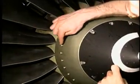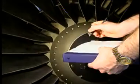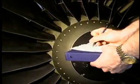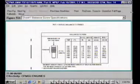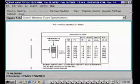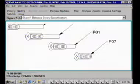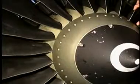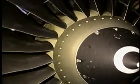Note that fan blade and balance screw numbering is counterclockwise forward-looking aft. At the first location to the left of the offset hole, record the P0 number on the head of the balance screw. If you cannot read the balance screw P0 number, measure the screw and determine its value on the chart in the Boeing Maintenance Manual. Note that P07 screws are zero weights and do not need to be recorded on the balance sheet. Continue to record the balance screw P0 numbers until you have recorded all 36 hole locations.